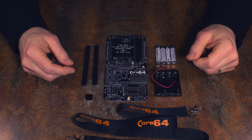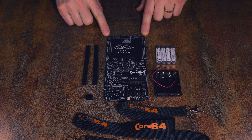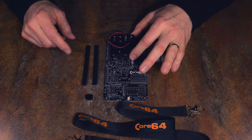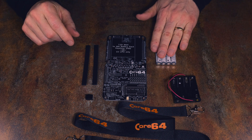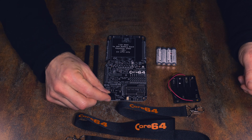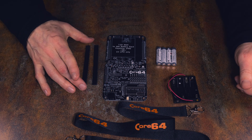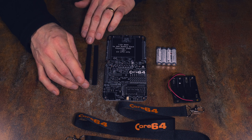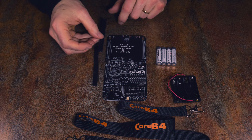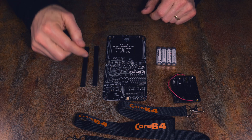The first kit we'll go through is the logic board kit. It comes with an optional lanyard you can install or not, which secures up here. A battery pack holder with double stick tape on the back, designed to go here and get soldered into the board. Four triple-A batteries, an add-on accessory port connector that can be installed here or on the top of the core board, and then two rows of female headers. These get cut down and put into these holes. You need two pieces to get all 20 positions on each side out of a 40-pin connector when you cut it in the middle.